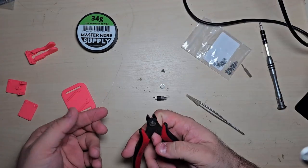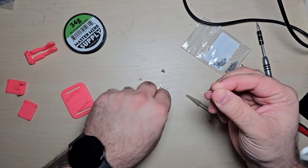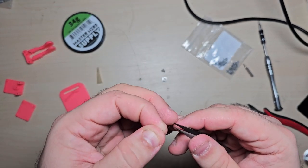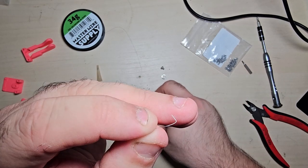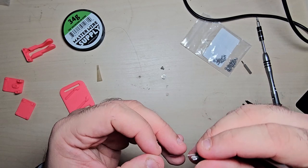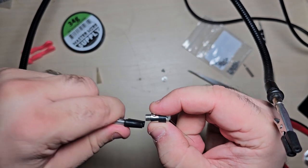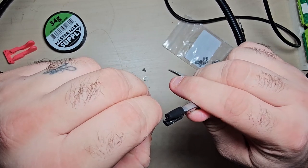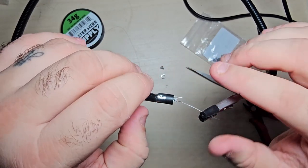His instructions say to take about an inch; I do a little more. There's 250 feet of this stuff so it's pretty thin, but what I like to do — don't put this down once you cut it because you'll never find it again. I like to put a little bend in this, just a little bit, almost not quite 90 degrees. That way I can hook it in and then kind of pinch it shut. Get some helping hands to hold the pieces — if you don't have helping hands and you're getting into a lot of soldering stuff, I recommend you get some. This wire is very thin and can be kind of hard to handle.